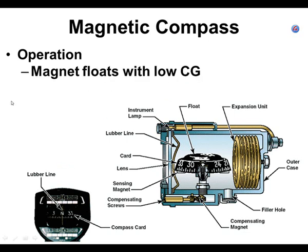Now, finally, compasses. You've got a magnet, and the north-seeking end of a magnet is actually the south pole — opposites attract. If you're looking at a compass aiming toward magnetic north, there's a magnet on that card; the south pole is being attracted by the earth's north pole. So it's the north-seeking end, but you're looking at the opposite end of the card.